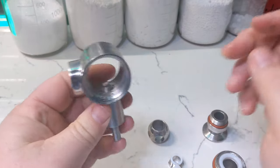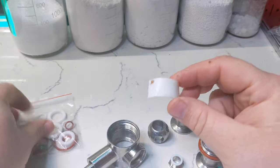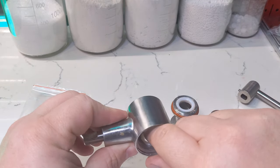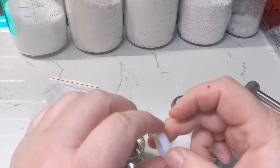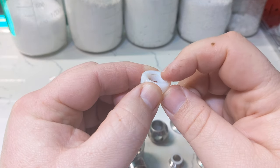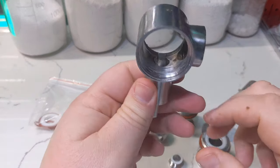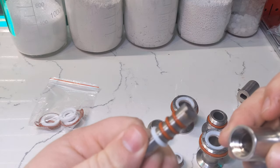So yeah, that's what the inside of the valves looks like. That's kind of the bulk of the pieces - sorry, my hands are nasty. At least this stuff doesn't stink. This guy isn't in the kit - it must just be the back seal or whatever that ball rides on. There's one more - looks like the o-rings and seals for the ports are in there. This guy is directional, so there's a bevel where that ball sits in it. When you put it back, you want to get it oriented the right way. It pushes right out the stem - there's a bunch of o-rings.